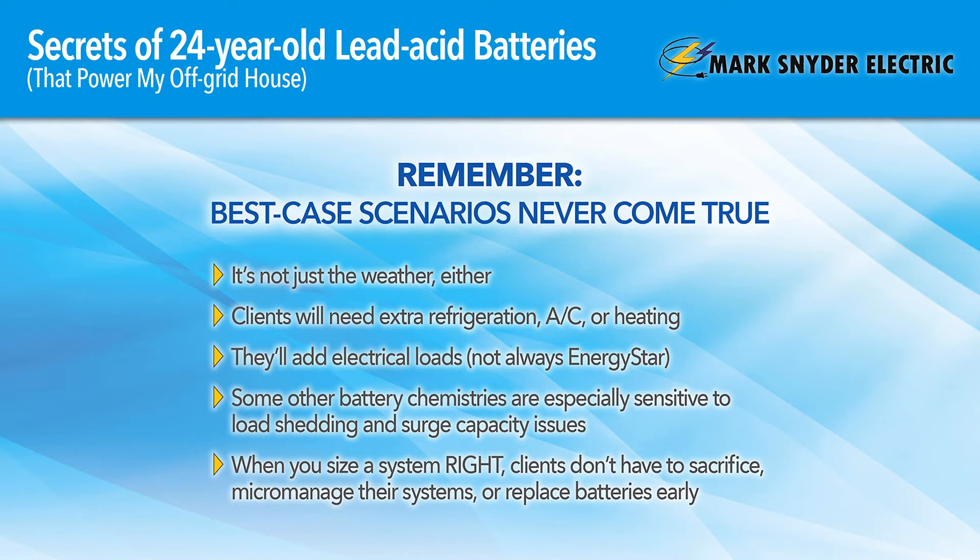You have to be careful and watch that C20 discharge rate. If you're off-grid, you're going to want to discharge that battery over 20 hours and watch that rate. The deeper you discharge them — if you're putting a compressor-driven air conditioner onto a lead-acid, lithium, or AGM battery — you're going to drop them into that 5-hour or 10-hour rate and you're going to end up having to work harder. More cycles, less lifetime, and a lot more work to keep them equalized.